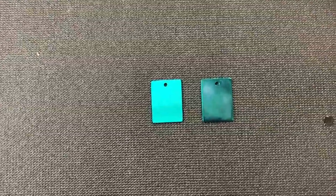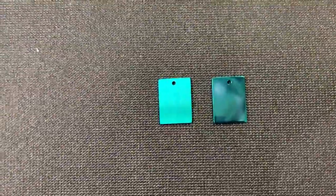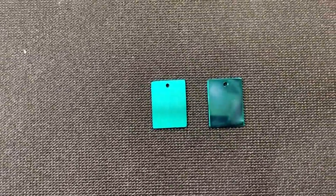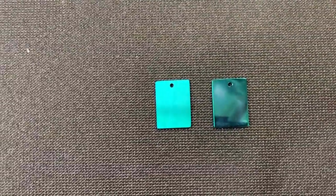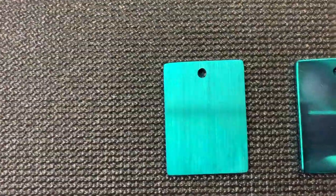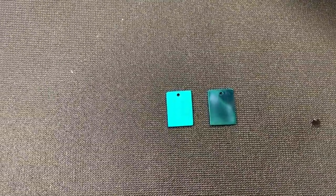Really what I'm trying to show everybody is that the surface finish you have on titanium makes a big difference as you anodize through the spectrum. I said it before, but this is why we never call out colors just based on the voltage — it's the same voltage but you get very different results. I just wanted to show you guys the effect and have a little fun with electricity and chemicals, like I always do.